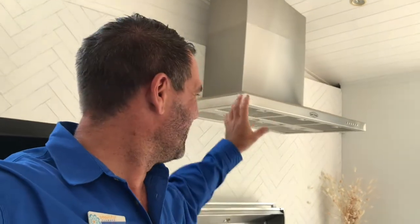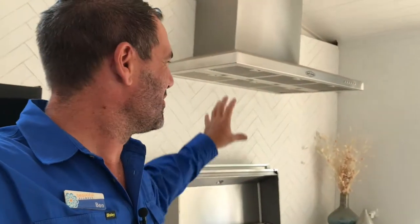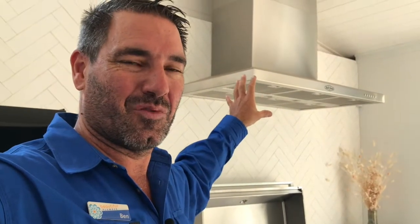So this is how it works. If you've got an indoor barbecue, you really need to have this range hood on, sucking all the fumes out from the room while it's working. But the thing is, what if someone forgets to put the range hood on and all those fumes go in — you get the headache, you get the carbon monoxide poisoning. What the interlock system is: it won't let any gas into the barbecue unless that range hood is working.